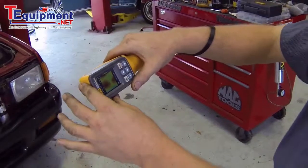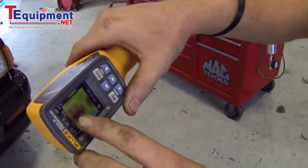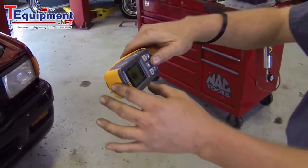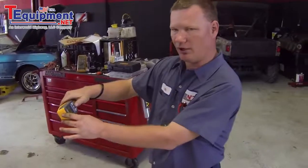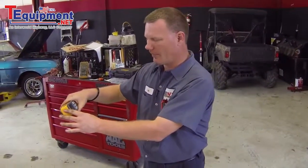You can also see the discharge line running in the front is a little bit warmer than the rest, which is normal. We want to see about a 20 to 30 degree temperature drop across the condenser. We would also be looking for any cold spots on the condenser, which would indicate a restriction or blockage of freon flow that may cause the system to not function properly.